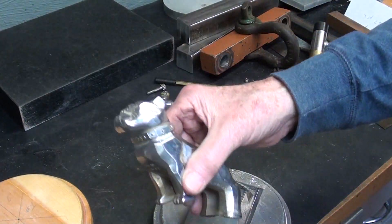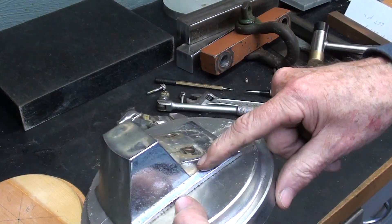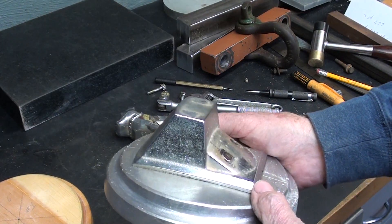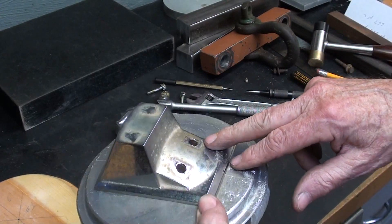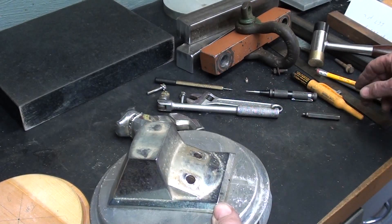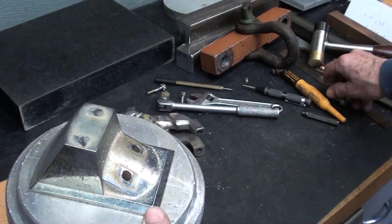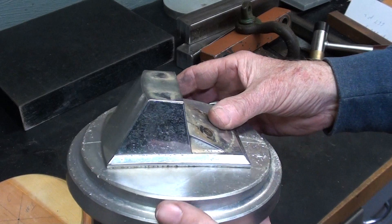Now, the actual Bulldog will be fastened with two metric bolts that come in at an oblique angle. So what I'm going to have to do now is get those marked, and then go over to the milling machine and just mill some relief for those heads — something at an angle like that. I think I'll run a transfer punch in there; that might give me an idea about where to do it. Note the curvature is quite good.